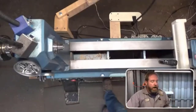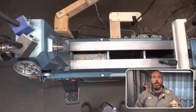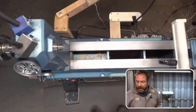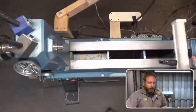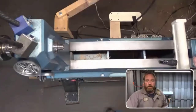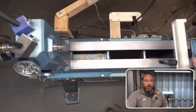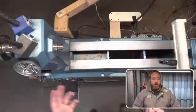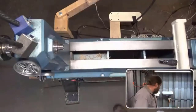So on Sunday, I would make sure that I have at least the first two ring layers glued up and dried on my lathe. Then I can always spend 5 or 10 minutes each night adding a secondary layer. Again, working a full-time job, there's a lot of weeks where I don't get any turning done during the week, so I'm more of a weekend turner. But I can certainly spare 5 or 10 minutes to run downstairs to my shop and glue on the next layer, so that by the next weekend, my whole piece is already rough turned, all the pieces are glued together, and I'm ready to do the final turn. So it works for me.